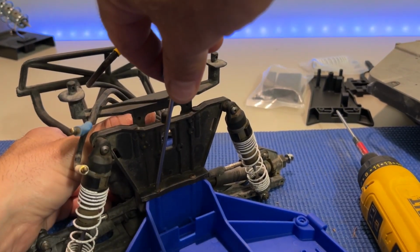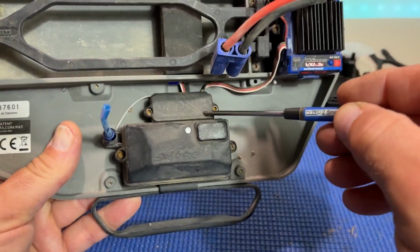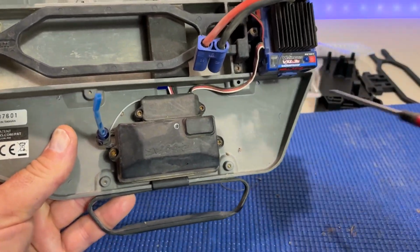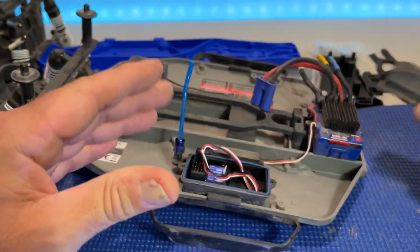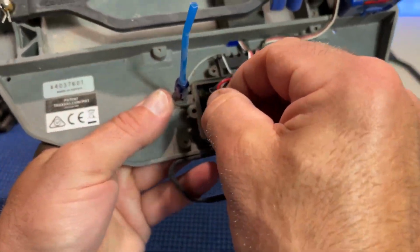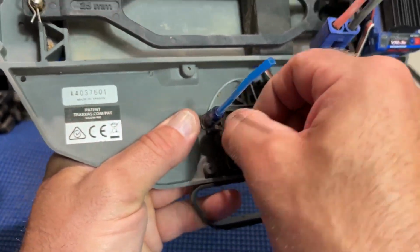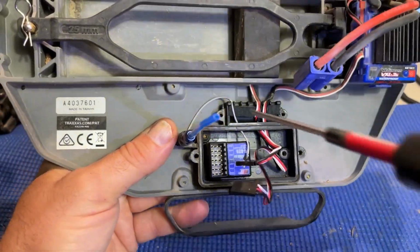I do have a clutch on my cordless screwdriver. Don't beat up these screws too badly. Finish off by hand. So there's basically 6 screws here to remove the receiver box. We want to remove it fully. There's the gasket that makes this waterproof. Unplug your cabling and slowly fish them out of this box.